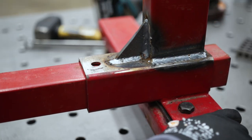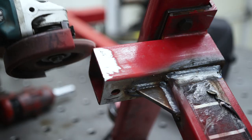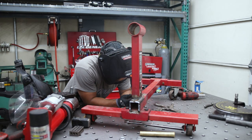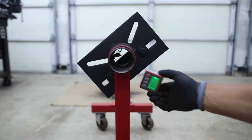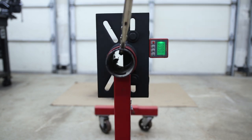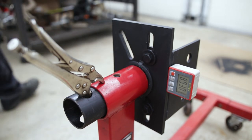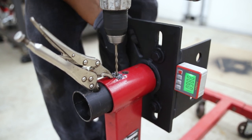Next was to get rid of the wobble at the base. Originally there's a bolt that holds it all together but it doesn't do a good job, so I made it more permanent by welding it. To keep the head locked in the vertical position I had to drill out a second hole for the locking pin — there wasn't enough meat on the head for the original hole, so I drilled a new set of holes in the back.